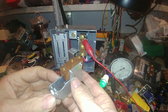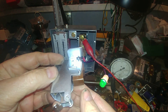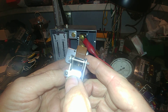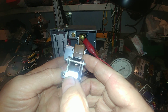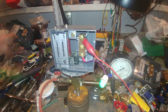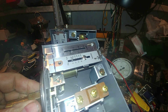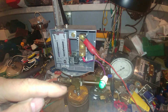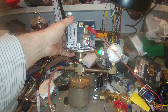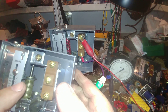This is the sub-assembly for the micro switch. There are two terminals, R to B — red to blue for BTU. And here is the cam in the back. That's the movement that is necessary to get that to turn on and off. These sub-assemblies with the micro switch are the same throughout. This is a L404F 1367 — same sub-assembly. The major difference is the spring. It's kind of yellowish. And you can see this main spring here is red.